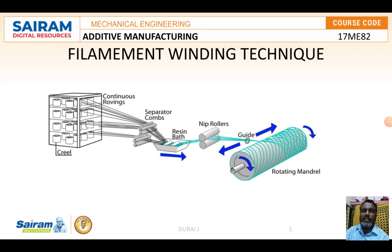The filament winding technique is widely used for creating reinforced plastics. It is used to produce high-pressure cylinders, storage tanks, and rocket motor bodies. In this process, continuous lengths of strand, roving, and woven tape are used. The fiber is passed through a bath of resin to coat it. As the strand comes out, excess resin is wiped off. The filament or strand is then wound over a mandrel of the required shape and subsequently cured under heat.